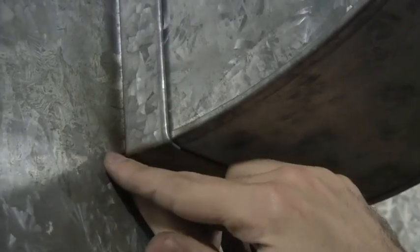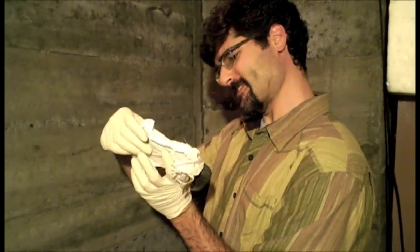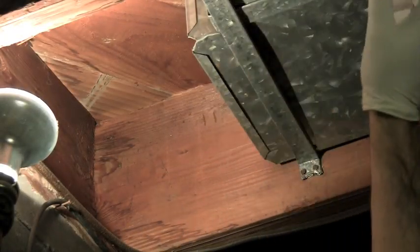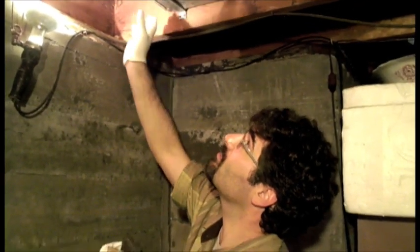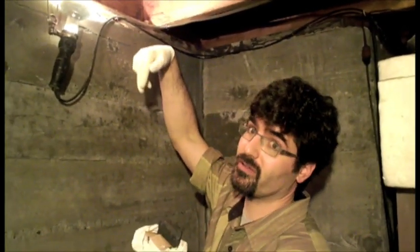Air is clearly moving out of here — this is where the highest pressures and highest heats are. Even a tiny little hole here can heat the volume of this space, and you really want to seal that up. So we're going to wipe this down and probably put duct mastic here because it resists dust, noise, and moisture — it's non-hardening and adheres to metal, wood, plastic, rubber, and painted surfaces.